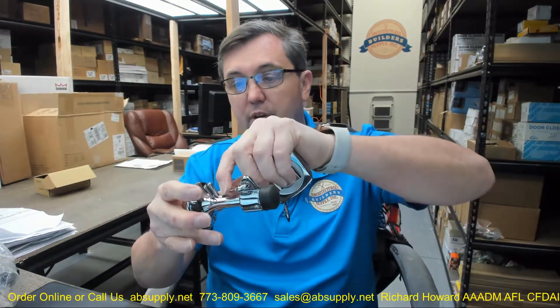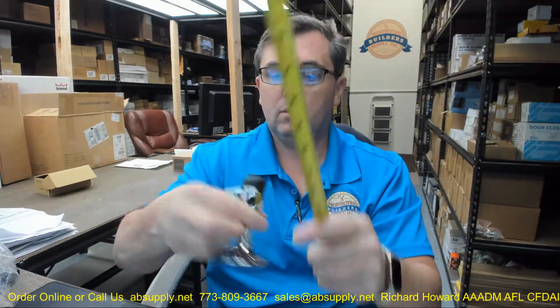Now for individual dimensions: I would sure like if the holder was insulated from the rest of the assembly — there's no damage on this at all — but I would like to see a packing material on this hook, especially on plated finishes. Overall projection is about 3 and 11/16 inches. Overall diameter of the base is about 2 and 1/8 inches. The staple portion has an overall height of 1 and 1/2 inches, a width of about 3/4 inch, and a total projection of about 13/16 inches.